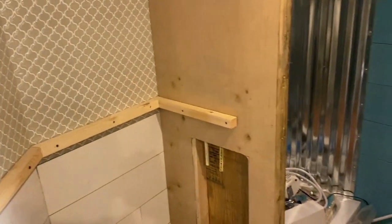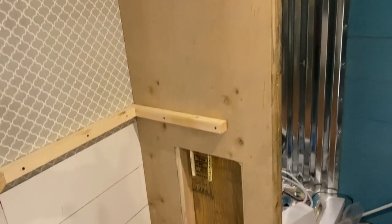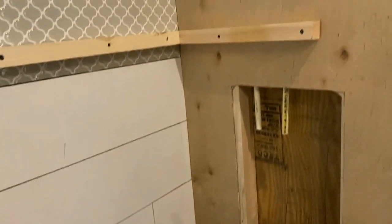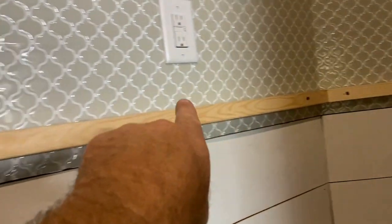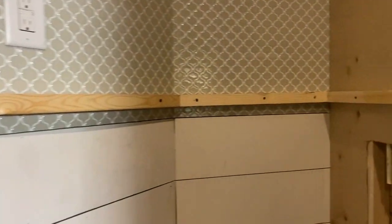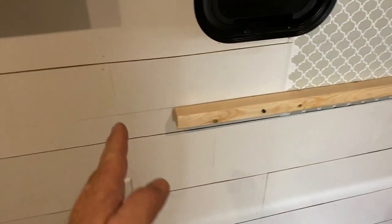It's another day and we're out here working on the camper after we got off from work. Here's what we've done: that wall is finished up there, completely nailed up, cut an access hole to the plumbing, and I've got it stubbed out so I can tie in to the sink, the water heater, and the water pump. The countertop will sit on top of this two-by-two band that I've got up there.